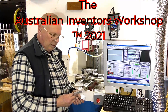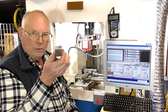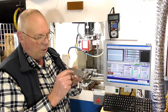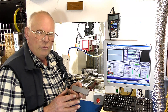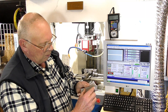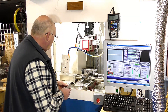I've cut off a few lengths, actually four, off a 12mm, nearly half an inch, flat bar. What I'm going to do is just put a nice slot in this, about 5/16, just over 5/16, 9mm, something like that. A slot for about two thirds of the way, like this. That normally gives you a good clamping performance.